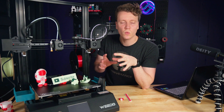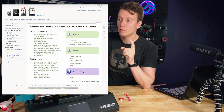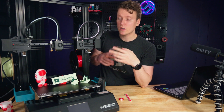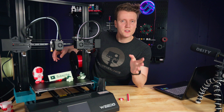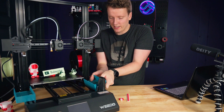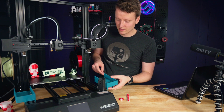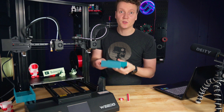Another downside is that their website wiki answers some questions but isn't the best laid out. I had to go onto their YouTube channel to find where they explain how to tighten the belts — both X belts came loose out of the box. They do have a good video explaining how to fix that, though. Another downside is the purge bucket: every time the nozzles go over to the edge, a little bit of filament falls down, and it's almost necessary to print out little baskets to catch anything that falls. Otherwise you'll have bits of filament everywhere.